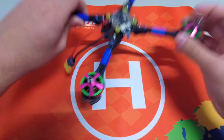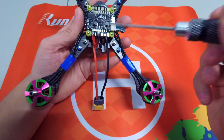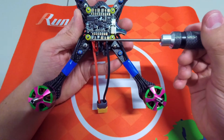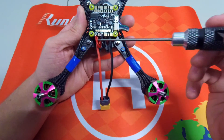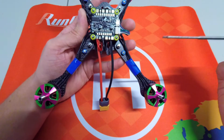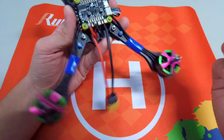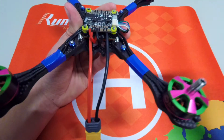Another thing: when wiring from the ESC up to your flight controller, make sure your positive and negative are from the same motor pads. In this case I'm using the ESC pads for motor three. If you use positive on motor three and ground on motor one, you will probably have some issues. Just to be safe, use the same motor pads — it also made it a little bit easier to route the wires down to the pads underneath the flight controller.